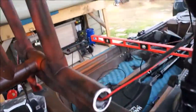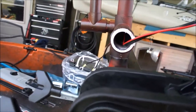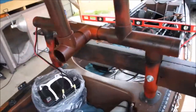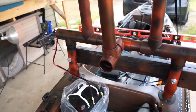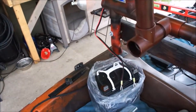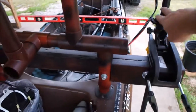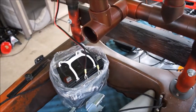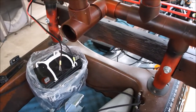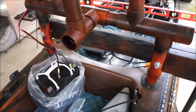But one other thing that I wanted to add was, since I cut those trolling arms off, I took the wire coming out of the trolling motor, ran it through the rod holder, and it is the perfect amount to go over here to this battery. And it doesn't even move that much when you're turning, because it's such a small turn as far as radius with the wire, so there's plenty of room. And if you wanted to even spin it all the way around, there would still be enough wire over there to go backwards, everything.